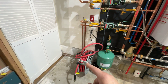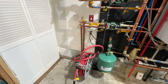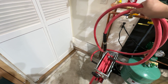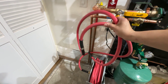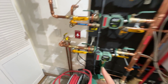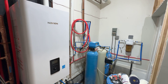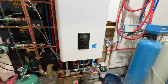I also hooked up a hot water hose reel here. Whenever you're draining the system or bleeding a zone or something, you'd have to get a hose out and wrestle with it, and it's a big mess. Not doing that anymore. So I got a hose reel here — for four in the morning when you've got a problem and need to flush your system or do some work. I got two hoses here so I can hook up my transfer pump in between them. The primary hose is six feet — it reaches all the valves in this system — or I can have a 12-foot hose if need be. I've also got water here if I need to flush a zone or flush the heat exchanger when I service the domestic hot water.